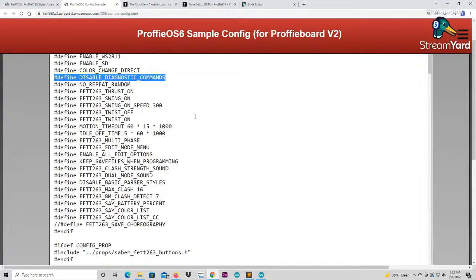And that's where the idea of saving space comes into play even more, is combining the similar styles into one, and then using the capability of copying that preset out instead of taking up memory. So when you make a copy of a preset, all you're doing is reusing that code in a different place. So the code is what takes up space on your board, but reusing it doesn't. So this way, instead of having 6 presets to get 6 options, you can have one preset that can get 36 or 48 or 72 or 1200 options, and then add another preset.